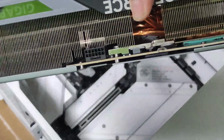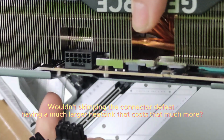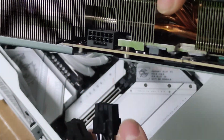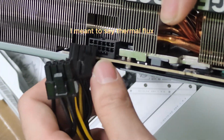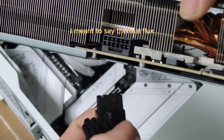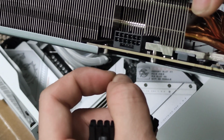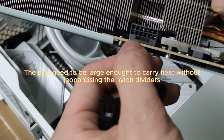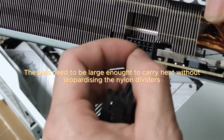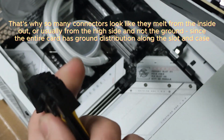But you've halved the size of the connectors. Just for example, look at the size and the distance of each pin, which will allow more thermal mass to spread out, or more thermal peak load to spread out between the connectors and not create any hot spots between the connectors themselves. Or say if 2 pins are getting hot, the middle one's going to be the hotter one, right? And if that one gets the same kind of heat as well, the entire center area is going to melt first, right? That's how heat really conducts through each other and affects the areas around it.